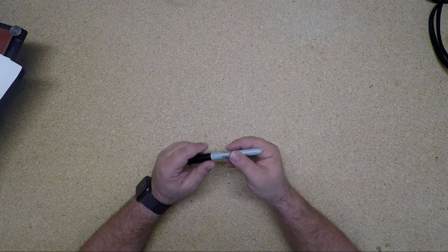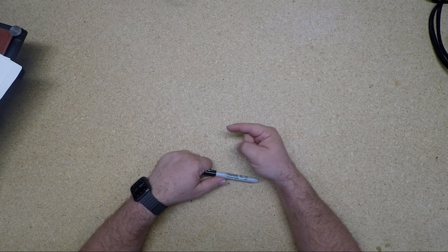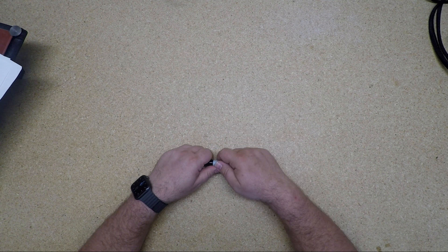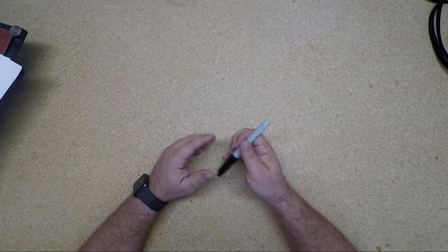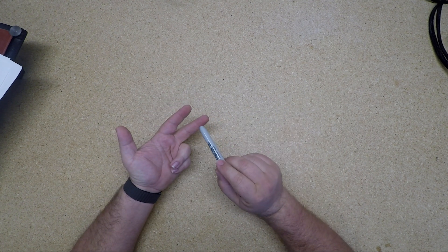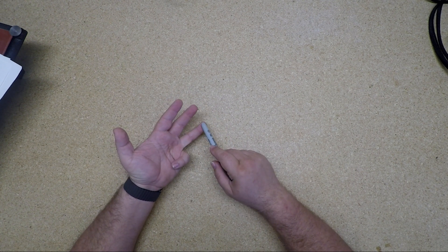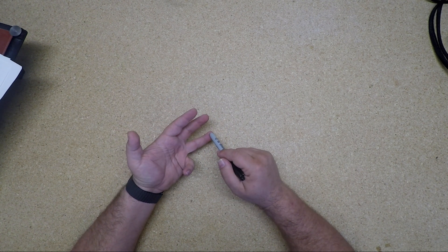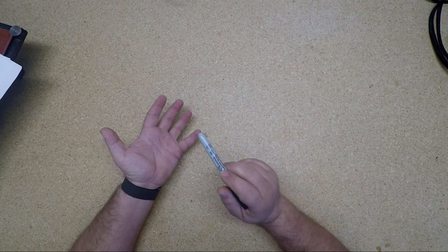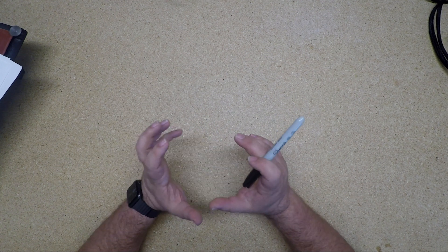So what's it going to take to do this? It's going to take a lot of 3D printing — thank God I have a secondary 3D printer. We need to print a new box, the BL Touch holder. We've got to get a control box going because we're going to move the controls to the outside of the printer. And of course, some feet with squash balls to lessen vibration. There's going to be a lot to this.